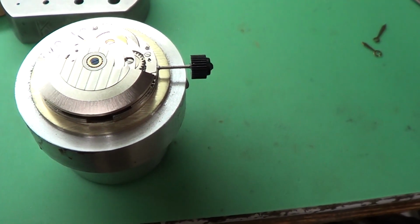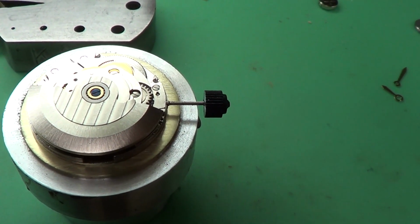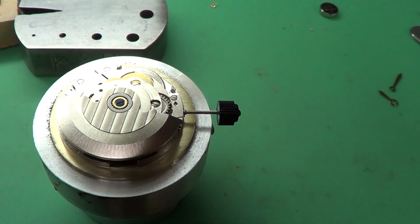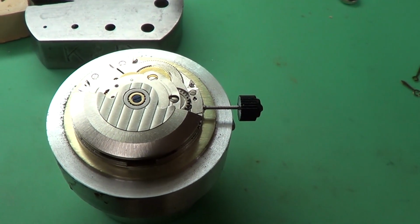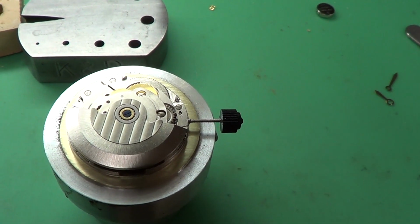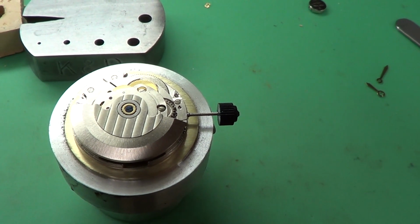So we'll contemplate tonight on the rest of that dial and decide what we're going to do, whether it's 29 or 30. I'd like to keep the watch at about 40 millimeters, similar to that of a Rolex, and we'll see what comes up, because I know it's going to be over $1,000 just to cast it in gold. My intention is to do this in wax on the CNC milling machine, and then cast the wax and then finish it up on the mill and on the lathe. I'm very experienced with lost wax casting. I've done it for years. I have 6,000 to 7,000 mountings that we built over the years and bought. So I do know the shrink values, and sometimes you get some warpage. But I think if it casts right and we do the right temperatures, we're going to get a nice casting, and we'll be able to finish it up.